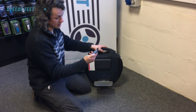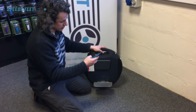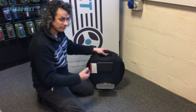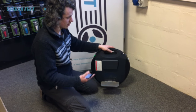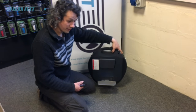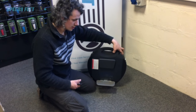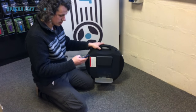It just says 'level correct.' You press that, it says no Bluetooth connected. The only message it gives you in the whole process is 'enter the horizontal alignment.' When it goes quiet, power down, power it back on, hold it in the exact same position, and then long beep means it's finished — just power it down. Simple as that. Hope that helps. Cheers guys.